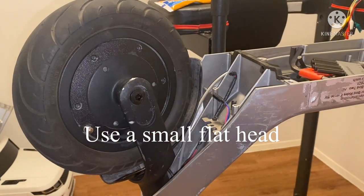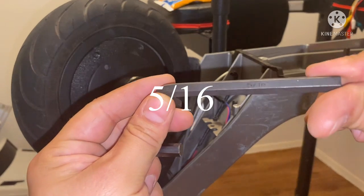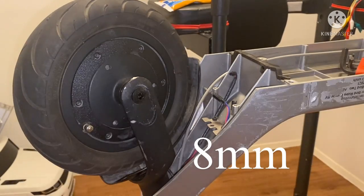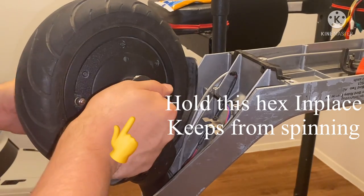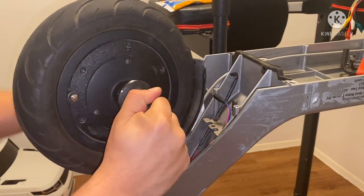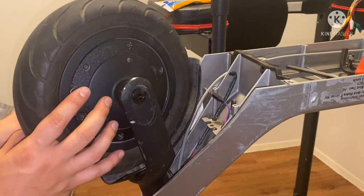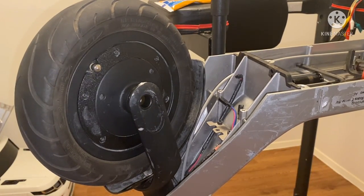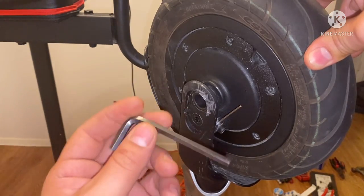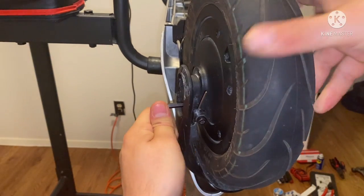That's it — now let's move on to the next step. Go ahead and take off these tabs. You're going to grab your hex — one is a 5/16th, the other is an 8 millimeter. If you just let it free you can see it spins while you move it, so you've got to hold tension on this and then loosen it. Push out this screw just like that.